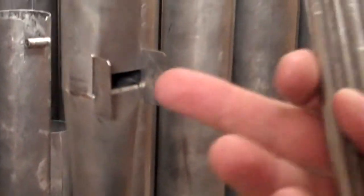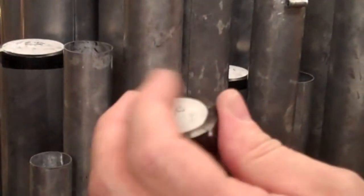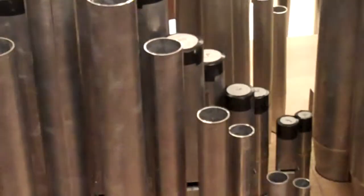And that would be the way the ones that are lead with the little lips that are vertically placed on the pipe that close in? The ears on the side. Ears, yeah. The ears actually do the tuning here, the same thing — pushing the ear in flattens the pipe and opening it. I had it opposite yesterday on the little video. In flattens it. Right. And the tops will get soldered on and we'll get rid of this tape and wash off the protective pipe coating when we get them actually to pitch.